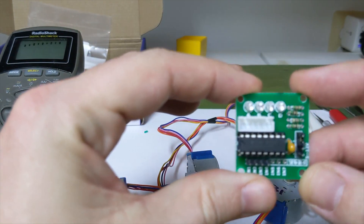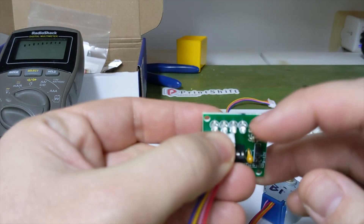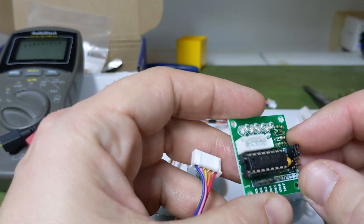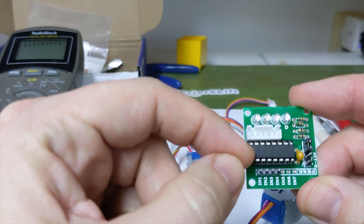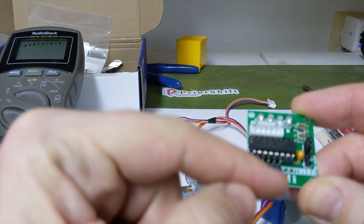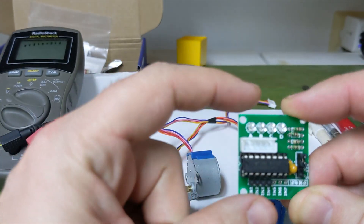This is intended to be the driver. The motor plugs right in, with little lights for each phase of the coil. You can run it off of five or twelve volts just by throwing it through some resistors. A Darlington transistor is just a high-powered transistor, so when you have an input on one, two, three, or four, it turns on the corresponding A, B, C, or D phase.